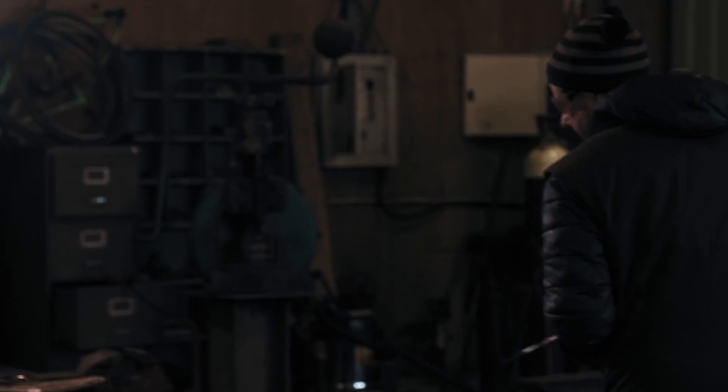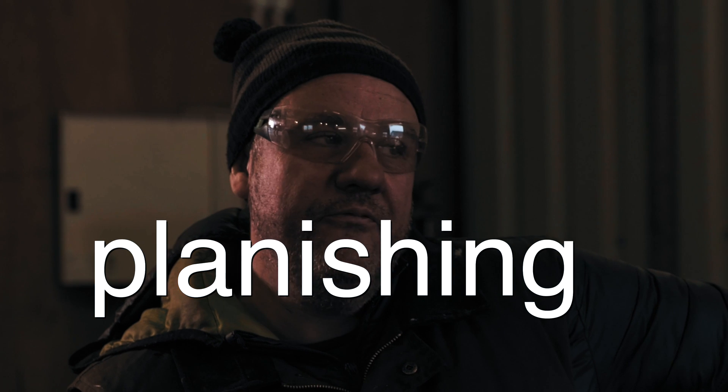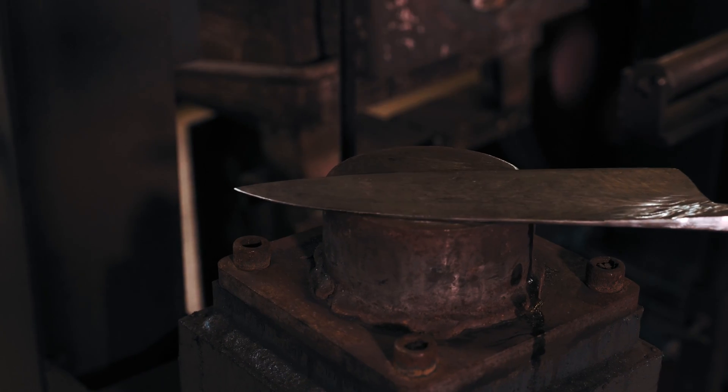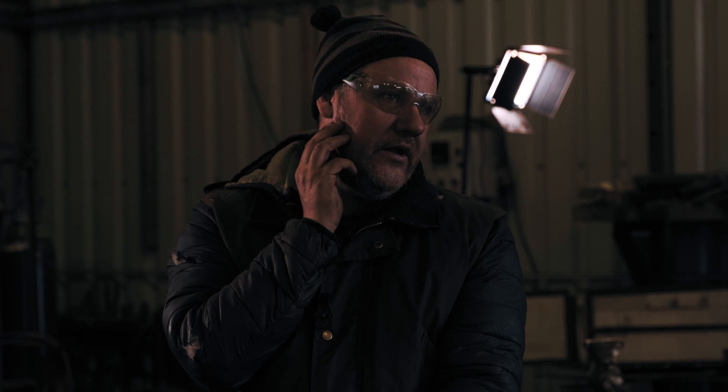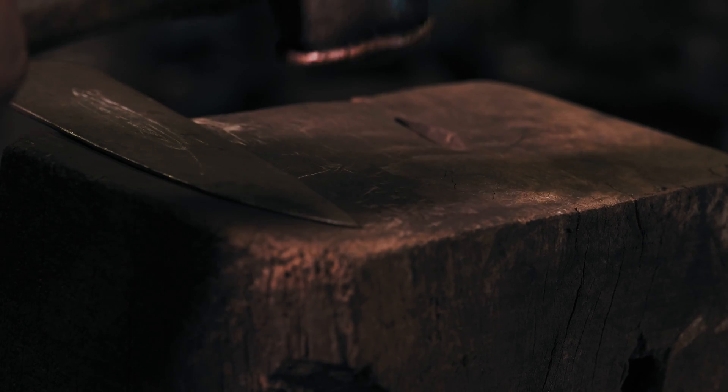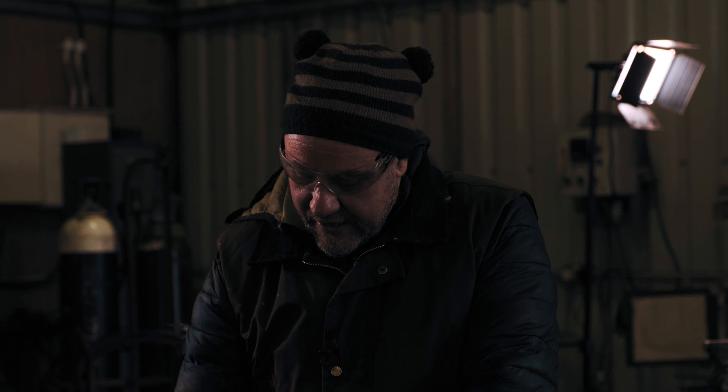Cold forging — it's the fun part. The other word for cold forging is planishing, which has a nice association with polishing. When I first started doing cold forging, the primary reason is for the surface finish. A lot of people get a bit muddled because there's cold forging at various stages in Japanese knife-making. One use is also descaling — you can do that on a stump by bending the metal one way, hollowing it, then the other way, and all the scale pops off.